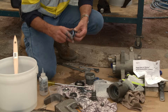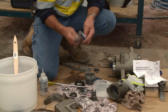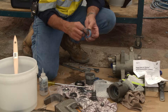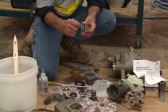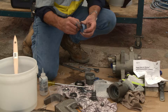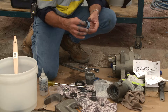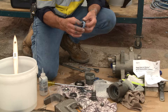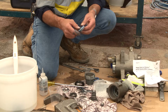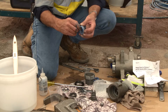These packings will have sustained a bit of wear. With these chevron seals, if they've had heat in them, what you'll find is they've umbrellaed on the inside and folded over. These pumps will only sustain a maximum of 20 seconds of free pump — meaning no fluid in the chamber and the piston is just running up and down through here, getting these seals hot. After that 20 seconds, you need to change the packings because you've compromised their integral strength and ability to seal onto the piston.